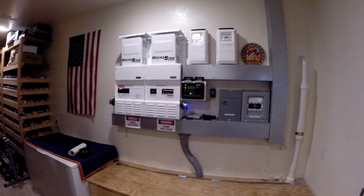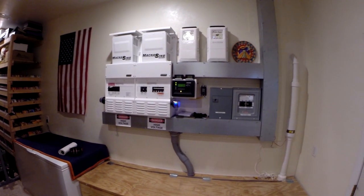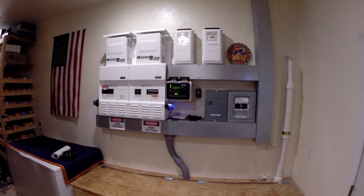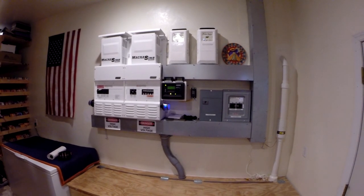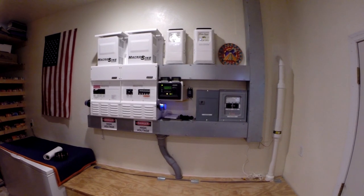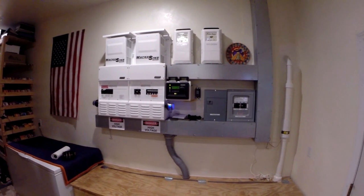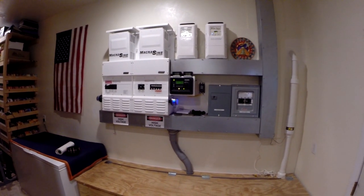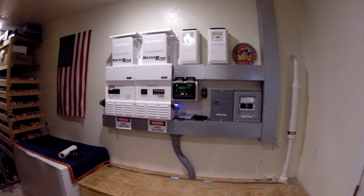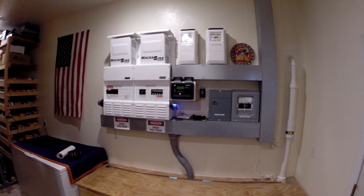The way I'm going to use this PTO generator actually works out really good. Because if you hooked it directly to the house and you were dumping loads on and off of it, it would change the tractor RPM and then the voltages would constantly be off. You'd have to have somebody sit on the tractor and adjust it constantly, or you'd have to have an auto throttle to maintain the PTO RPMs. So what I'm doing is I'm just going to put a constant load on it for 2 hours, max it out to 6,000 or 7,000 watts.